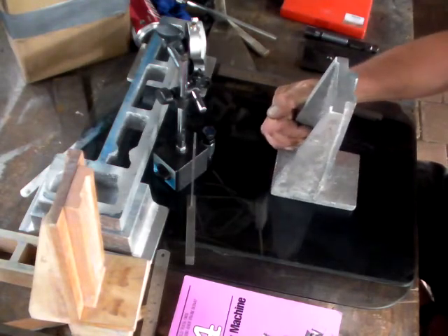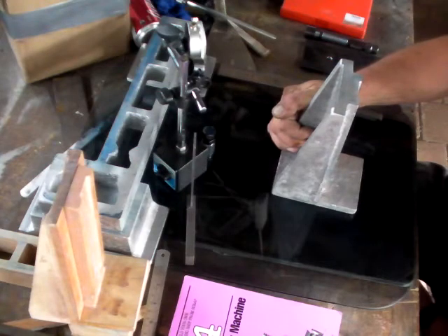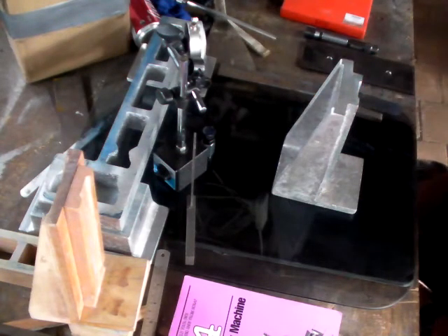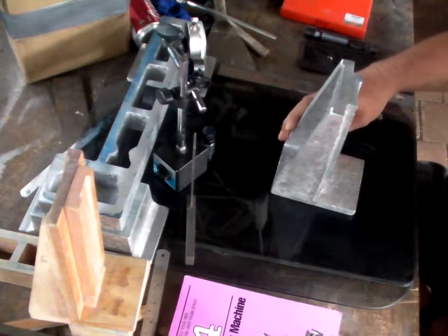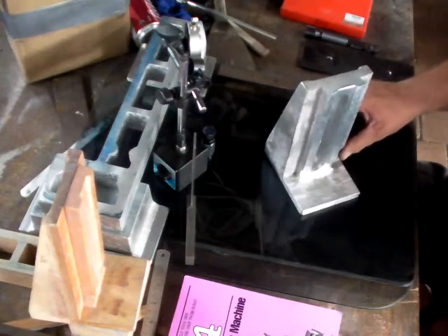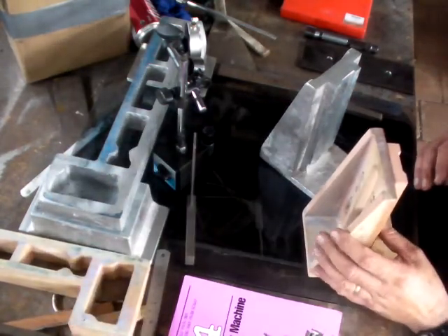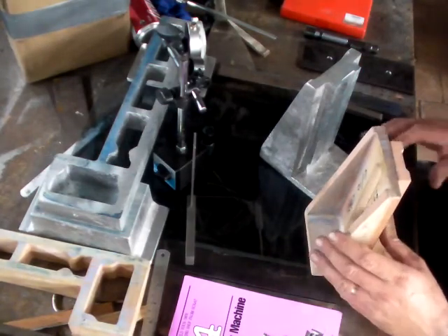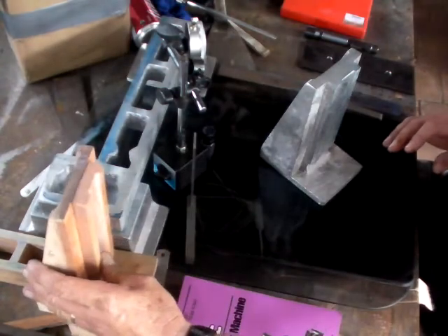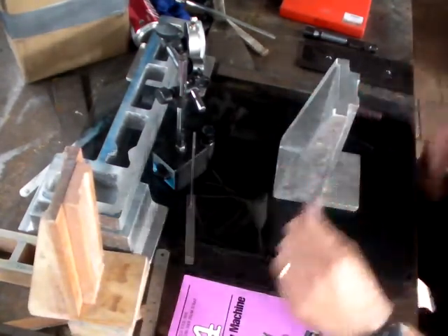I had a little bit of problems with the moulding sand. When you go to turn them over, they wanted to break. It took me three goes before I was successful in extracting the pattern and being able to successfully clean the imprint left in the mould in the sand and then ready to be poured.